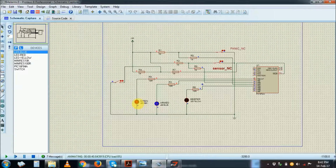Now the alarm sounds. If I come here and do this, I deactivate the alarm. So activate. It gives me 15 seconds to go out. Before that, I can actually violate it because nothing happens, because it's not in armed position. As long as this one turns blue, any violation will activate the alarm. So it waits for me to get to 15 seconds, and now it's active.